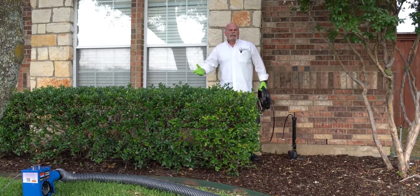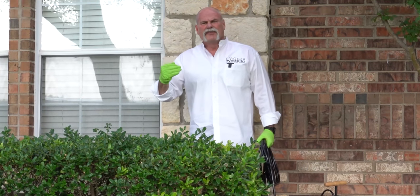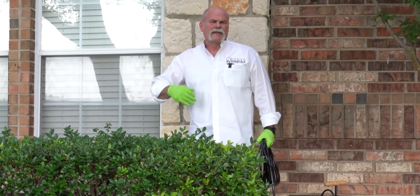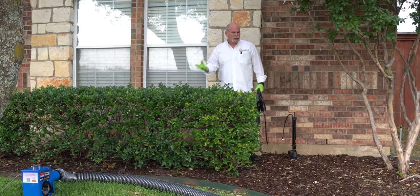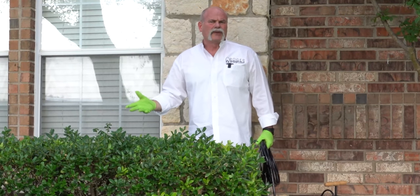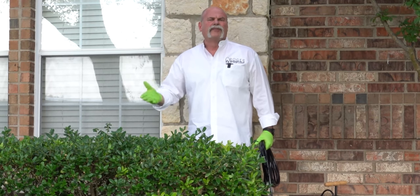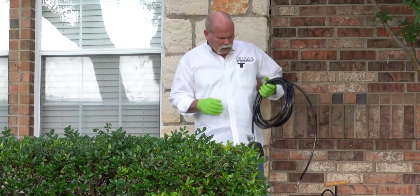Sometimes people have problems with a dry trap or something like that. So if you actually do have sewer gas smells in your house, you may just want to check and see if you've got a tub, a lavatory, anything like that that is dried out and maybe you're getting sewer gas smell back up from your sewer system. That's a normal thing. So if you do have traps that maybe don't get used often, it's a wise idea to go in there every now and then, turn the water on, fill the trap up. That way you don't have that sewer gas smell.